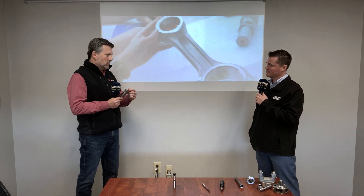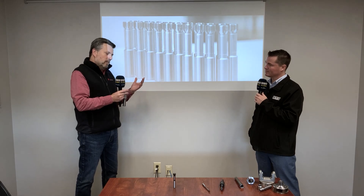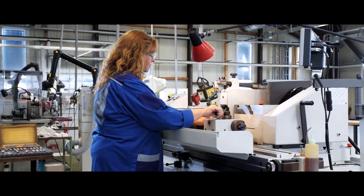When they come out of the box, they're ready to cut right to size. Normally, with the customer's input, we decide to shoot at a different part of their tolerance field, but they come in right at mean — right in the middle of their tolerance is where these are ground and where they cut when you start. As it wears, the expansion screw allows the customer to expand the reamer, get it back up into the middle of the tolerance, or maybe even above mean, to prolong tool life.